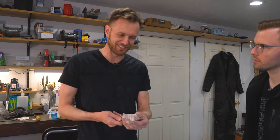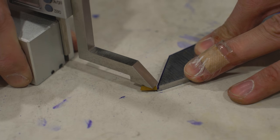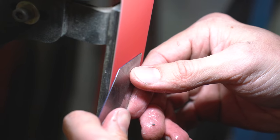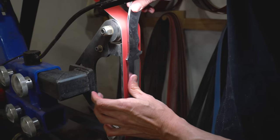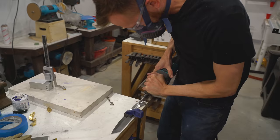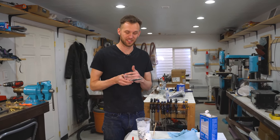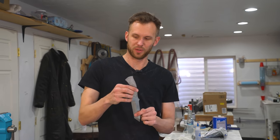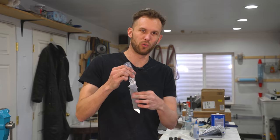I've never done the grinding of a knife blade made of meteorite before, so this is a first — it's going to be fun. Now we want to do the etch, which involves putting all of the meteorite portion of the knife in acid. We want a container that will hold the acid and the knife without using too much acid — something that fits the knife fairly well but will allow it to be fully submerged.